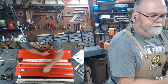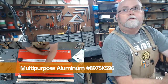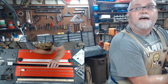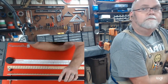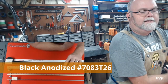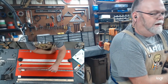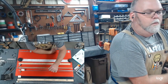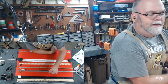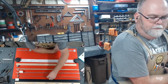The silver aluminum version McMaster Carr number is 8975K596. The other option I bought is some black anodized aluminum, same dimensions, McMaster Carr number 7083T26. This one here was just my prototype - I went to the hardware store and got some eighth-by-one aluminum from Home Depot or Ace Hardware. The eighth-inch thick prototype is too thin; I had to go to quarter-inch. But this is my prototype.